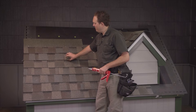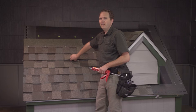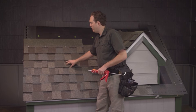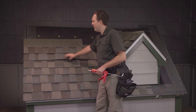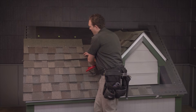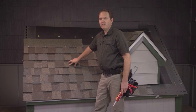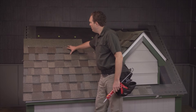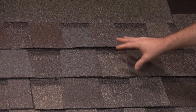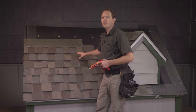What we have to watch out for is this old shingle that we left in place — the glue strip at its bottom edge has been damaged because it had already glued down and we broke that glue bond to get the shingle out. So this is the shingle we have to be really careful about gluing back down. I like to bring my sealant in and lay a nice fat bead of sealant all the way down underneath this shingle and press it into place, ensuring it's glued back down to the top of the replaced shingle. I also like to fill in the nail holes that we left open because we put the nails back in a new place. Feel free to put sealant wherever it looks like the shingles need some help holding down.